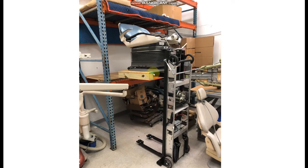Now, pay attention to the fact that there are not bottom stringers on this. It's not a pallet, it's a skid. So it's important to know that this is not a pallet jack. It's because the forks and the feet actually separate from one another, so you have to have an open bottom in order for that to work.